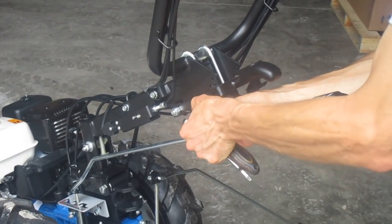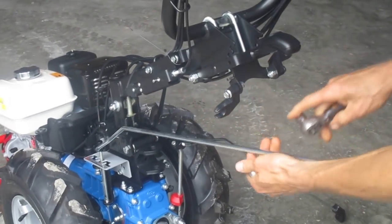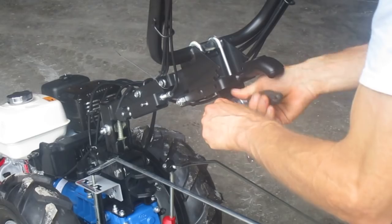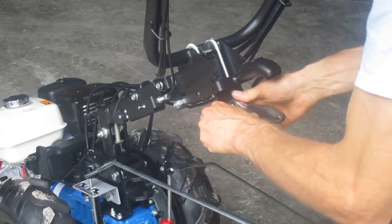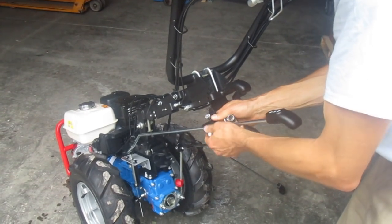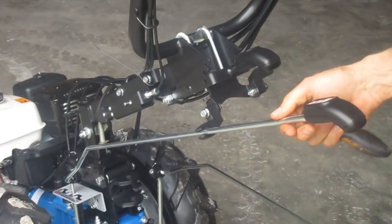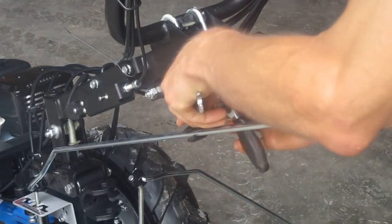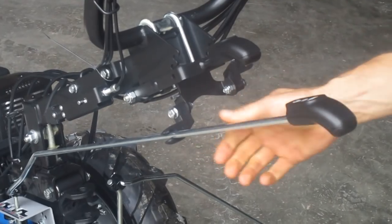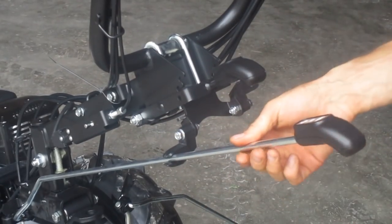I've rebelled against that and I do just what I showed earlier — I flip these things over. If you get a tractor from Earth Tools 2016 or later, it's probably got these flipped over. You just tighten them down and that allows you to index it a little bit. I'll bring it to the point where I can still wiggle the shift lever up and down slightly — there's a little bit of play, but it's a lot snugger and takes more effort to pop it out. That'll last much longer, and if it gets worn on that side, you can always index it back to the other side.